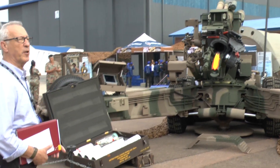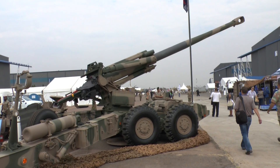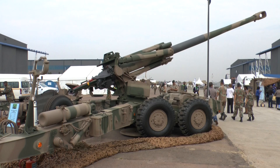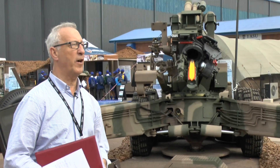The information comes from the command post into the gun, which is then laid on the target. The weapon is normally fitted with a muzzle velocity radar that measures any dispersion each time the shell is fired, and that information is fed back into the fire control system.